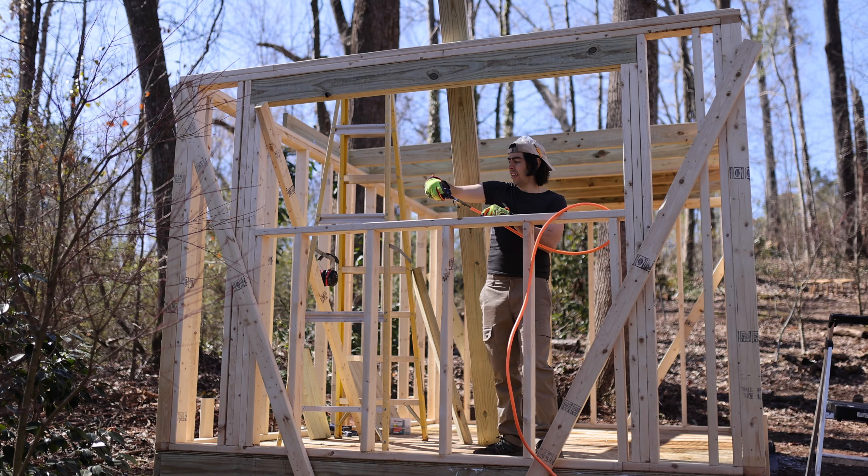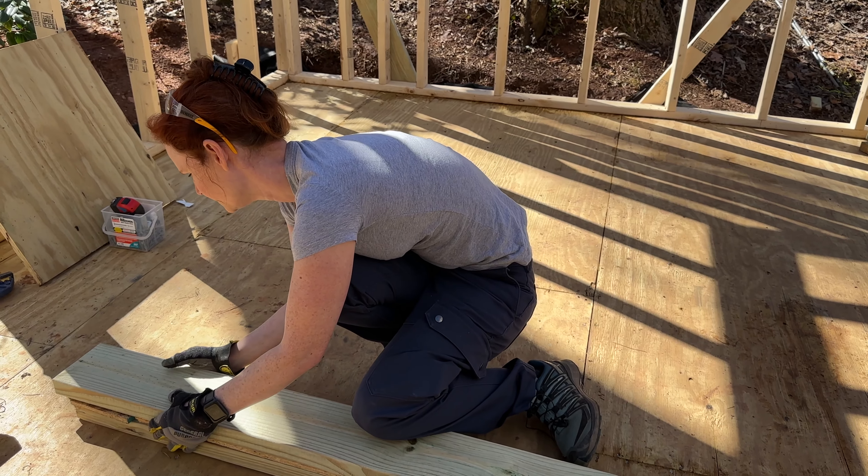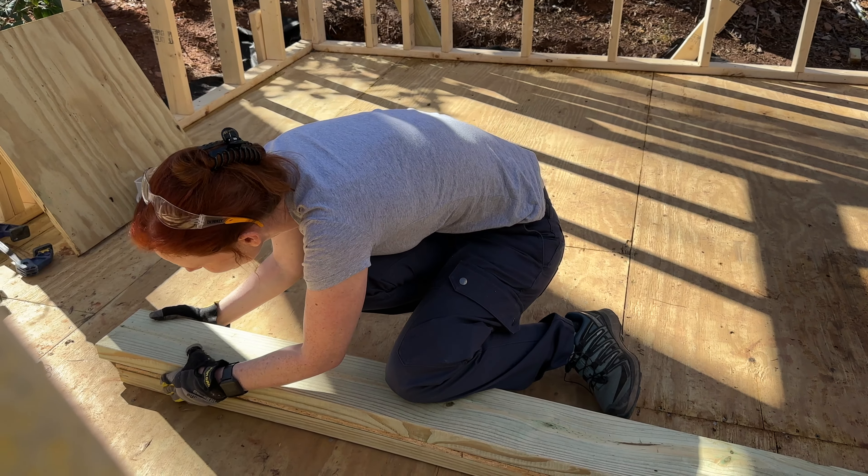Anna, tell me what we're doing. We're making what looks like a beam, but it's not a beam at all. We need to make a double trimmer — a double joist, but a trimmer for the attic stairs. Since it's going to be sitting on top of our wall directly, the opening is going to be flush with the wall. We just needed to pad it out so it's the right thickness of the wall, so we added OSB in the middle, just like you do for a header — but it's not a header. That's just so it is the same thickness as the 2x4s up there.